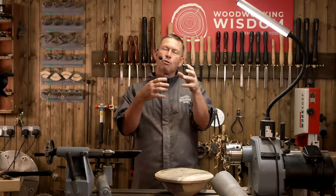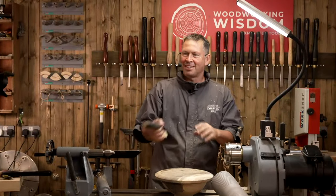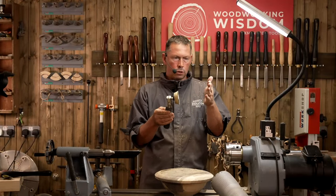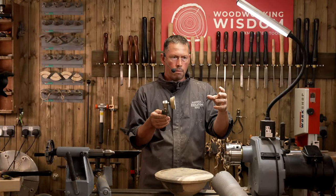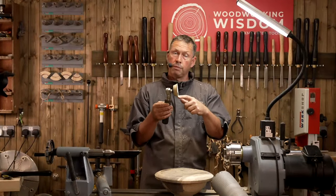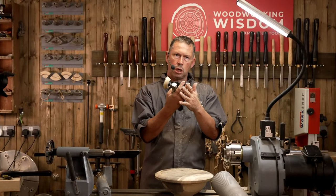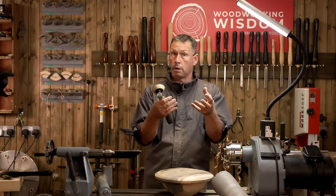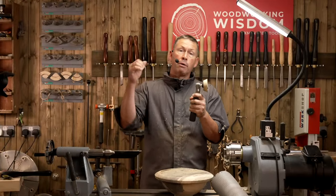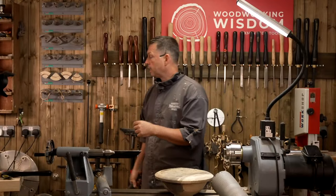Steph, I'll get it for you. Bowl sander, so a rotary sander that acts with the inertia of the bowl. She's on her hands and knees down here. Thank you very much. One of those little bowl sanders. So it reacts with the movement of the lathe. Hand sanding will be your first, the gentlest method of sanding. This is the next, but quicker, and power sanding the next, but even quicker again. But if you mix the hand sanding with one of these, they crisscross each other. So you get a quicker method of sanding, and you lose the scratches. They cancel each other out. So it's a really great way of working. So the power sander's only difference is a quicker and more aggressive method of the same thing. That's all it is. Yes, Steph.